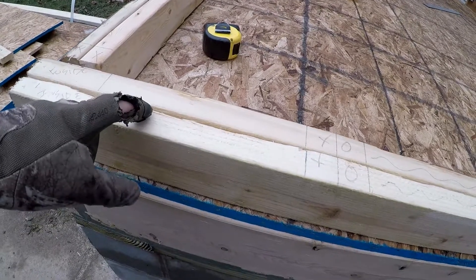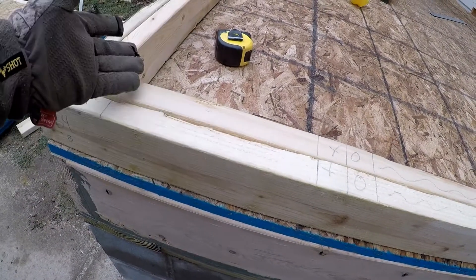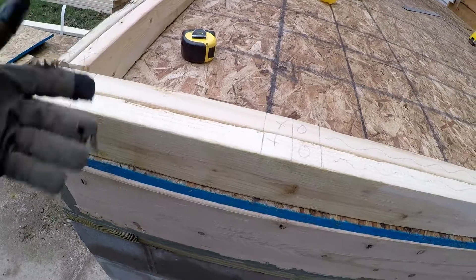And then in there will be one more wall, all with seven foot one and a half inch studs, with inch-and-a-half top plates, to give me a seven foot six finish framing.